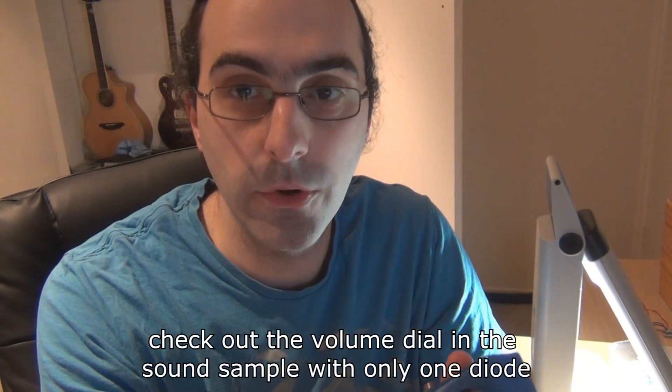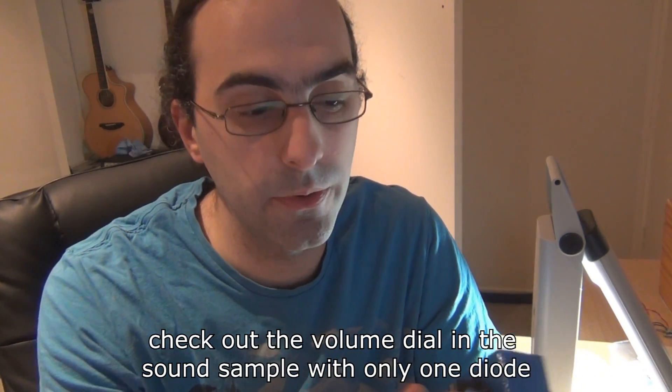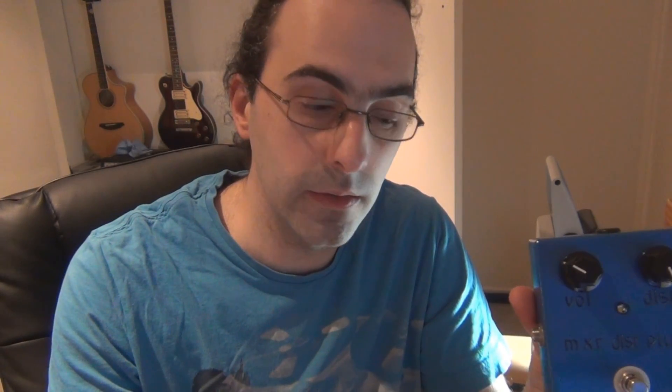So I haven't actually edited this video yet — I'm just going on what I just heard in front of the amp. But the transistor is definitely doing something, because when there's no diode in the first position and there's only one diode, the volume is a hell of a lot more — which is what it's supposed to do. You get a huge amount of volume out and not as much clipping. But when I put the germanium transistor in, unity is like sort of twelve o'clock or something like that.